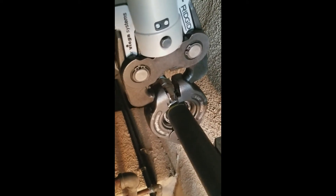One of the main issues with these press guns — on some of them, if you have the standard size gun, they're so big you have to really plan out where the gun is going to go. I have a whole mess of pipes here running in every direction. We're here to change the boiler, not re-pipe the whole house, so all that stuff has to stay and we need to press this in place where it is. Here we have the press ring in place and it's ready to be pressed.